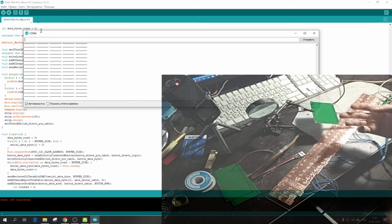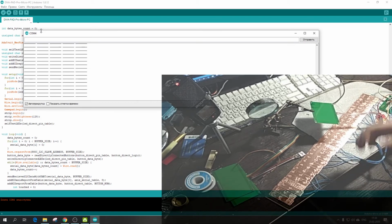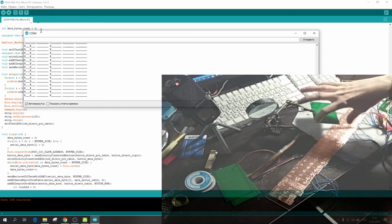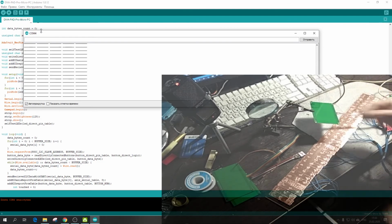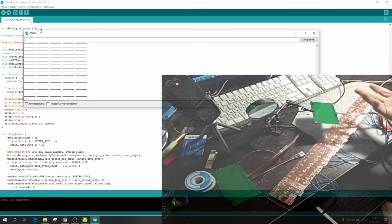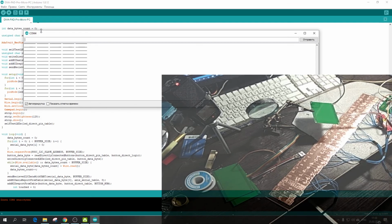That is why the official Project DIVA Arcade doesn't have any shield or ground hatching on its slider. And that is why I'm already making a third variant of this PCB without ground hatching again, but with bigger pads, and bigger mounting pads for wires, with holes maybe, and other changes. I hope it will finally work and be installed in my arcade controller.